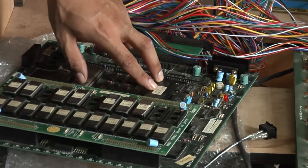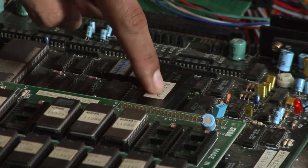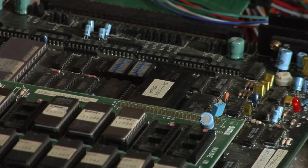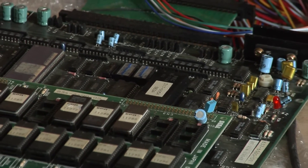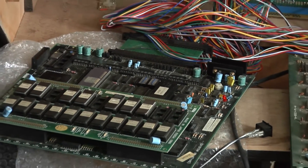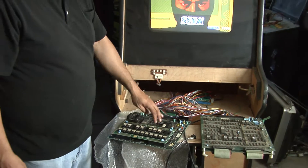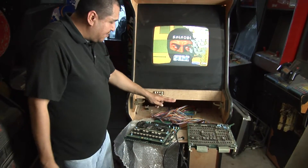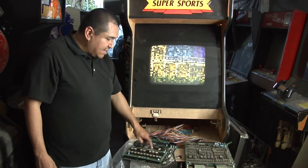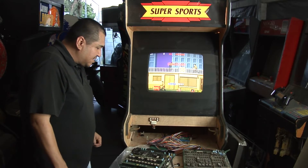What I found out is that Shinobi, or any of the System 16B type boards, has a security chip — this little guy right here: the NEC MC8123B. This one actually has a battery built into it, and once the battery dies it literally takes out the sound. On earlier versions it would kill the game itself entirely, but on this version it just takes out the sound.